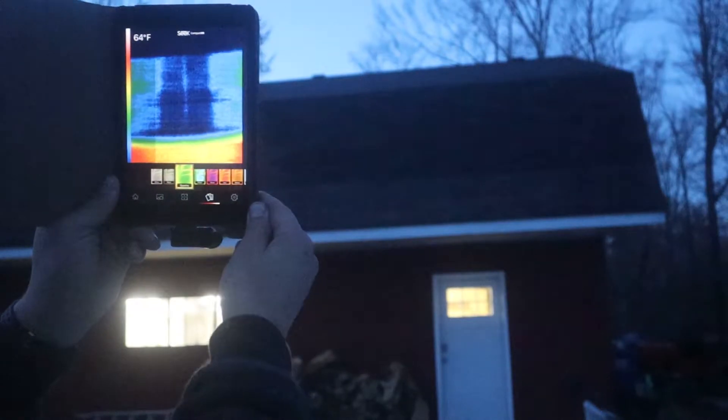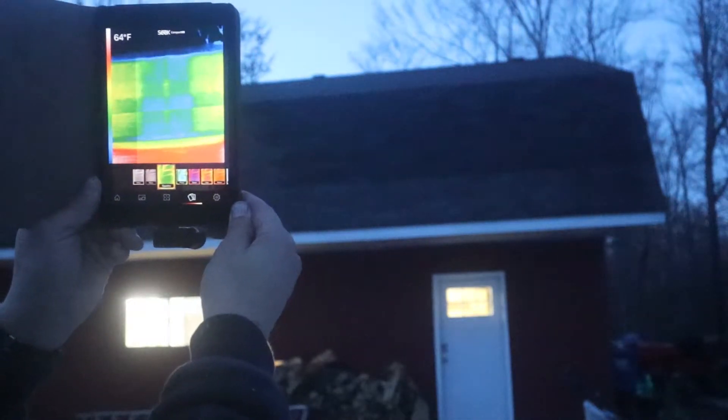There should be heat — it's nice and warm, we've had a fire in there all day — and when I move up, that's cold. So that tells me there's heat loss going on right there. Underneath there's no insulation, because it got all wet and disgusting, so we got rid of it when I made that patch.